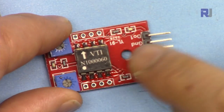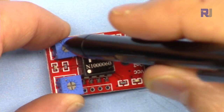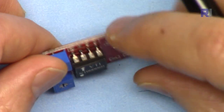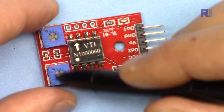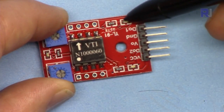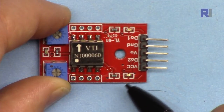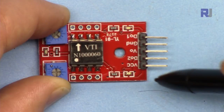The module has two LEDs. When it is absolutely flat you can set the threshold using the two variable resistors or potentiometers — these alarms are off by default. At the bottom we have an LM393, which is an operational amplifier. It will turn the LEDs on at a specific value to detect if it is flat or not, and the result is output as D-out 1 and D-out 2.